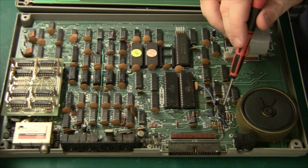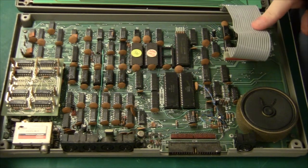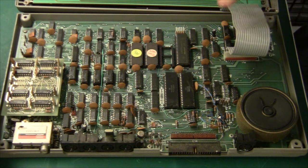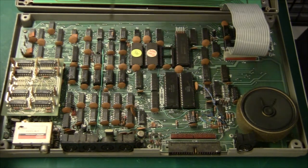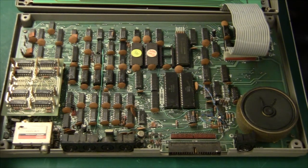There is some logic for driving the loudspeaker, but there is no audio chip. So the audio has to be quite minimal — some beeps, some buzzes, and very simple sounds. Basically the whole machine is a Z80 CPU with a BASIC ROM, a massive amount of logic to generate video, and a massive amount of logic to control the memory chips. Apart from that it is actually quite a basic machine. I also heard this machine was able to run CP/M if you were able to get the floppy drives, which would explain why the architecture is so simple — for backwards compatibility.